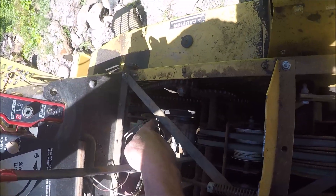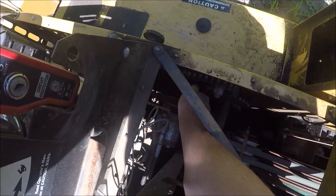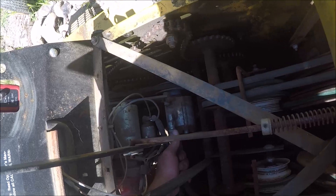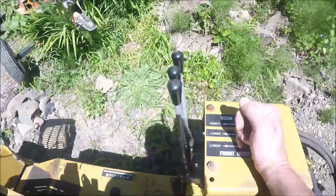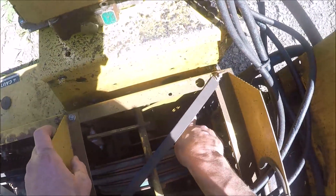Secondly, there is a pulley which runs a belt down here to this cute little hydraulic pump — little tiny guy. Pressure line here, which runs down and across, stays away from everything, comes up, goes over to your control quadrant for the hydraulics. Your return line runs all the way underneath everything, up here to an elbow, into the bottom of the tank.